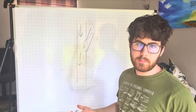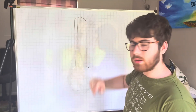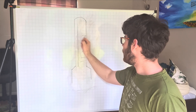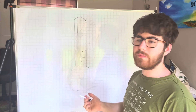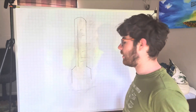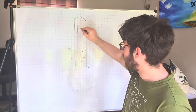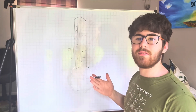So how does this apply to a bladeless fan? This is a cutaway of a Dyson Bladeless Fan — basically this is a side of the loop. The air is blown out from a slit on the edge of the hoop, and it goes in a direction kind of like this. And that air is sticky, and it sucks in the air in the middle of the fan. Think of it as a very short section of pipe — we get the air moving in the pipe, and then that sucks in air from behind, because air wants to fill in the low pressure area which is created at the back of this fan blade. And that is how a Dyson Bladeless Fan works.